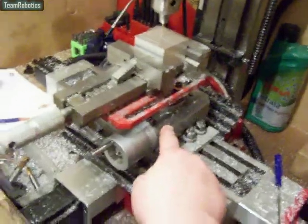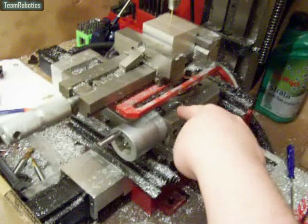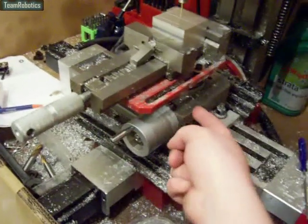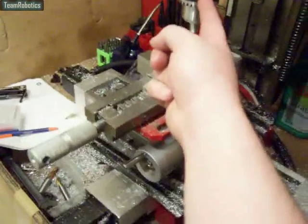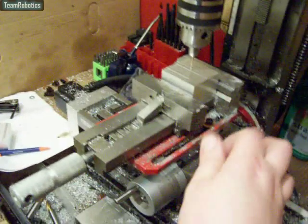Hi there, Tone. What I've had to do is lock the rotary table down onto the milling machine. Then once I've got that locked in place, I've had to centre that so the middle of it was smack bang underneath the drill. Then the vise has been secured to that, so I've had to get that perfectly spot on.